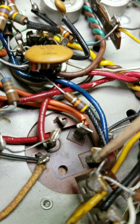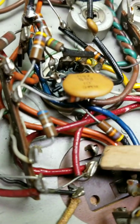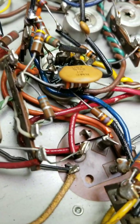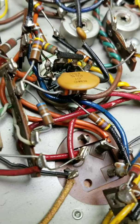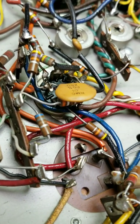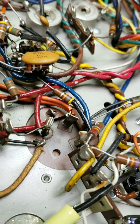This is a three-section capacitor. These other two sections are after dropping resistors, so they should have little to no ripple at two volts per centimeter. The one that goes to the output tubes — since it's only one stage after the initial one — sometimes you see a little bit of ripple, but it shouldn't be a lot, just very, very little. The third section you should see almost none, if not zero.